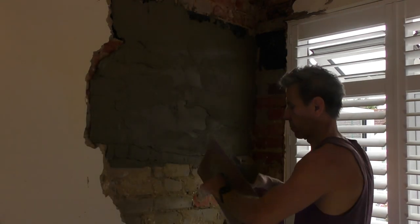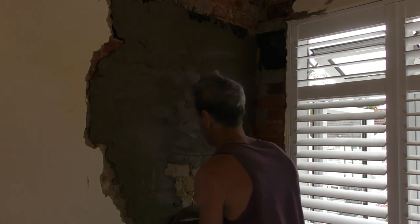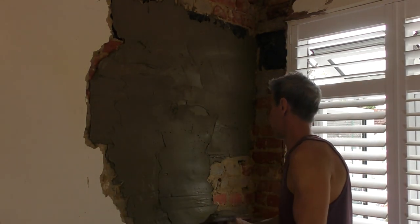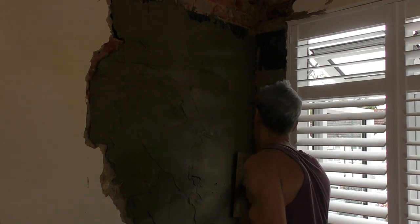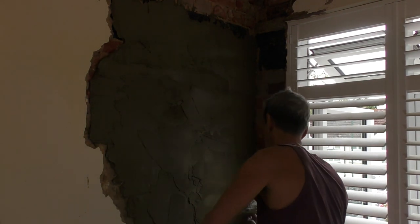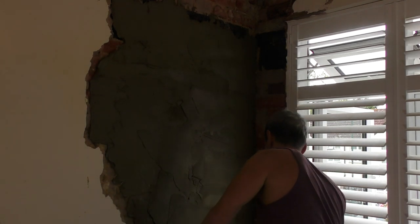Because it's just too small, a bit later on I'm going to build this up first with the sand cement corner, and then I'll use a thin coat bead to get the thing finished off. Now mostly when you're doing sand cement work like this, you'd put a scratch coat on first and then put a second coat on top of that, but in here we've only got about half an inch to play with.